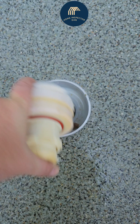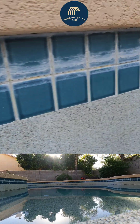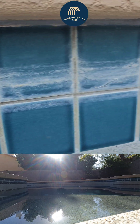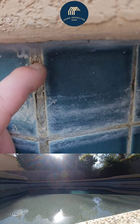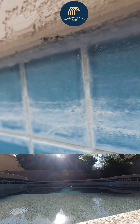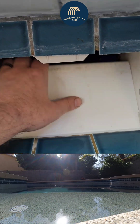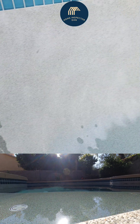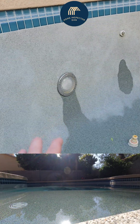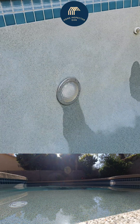The steps don't need as high a pressure. I'll probably do a little more cleaning and try to knock down some of this calcium the best I can — it's crazy. There are a couple of spots where I can put some caulking to fill in those gaps. Most of it's not pretty but it's done. Also, don't run your pool light too much if you're working in your pool without water — it needs the water to keep it cool or it'll overheat.